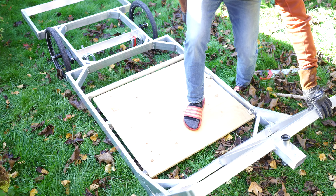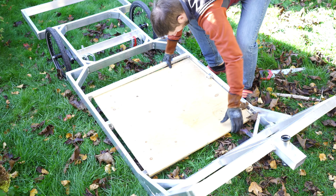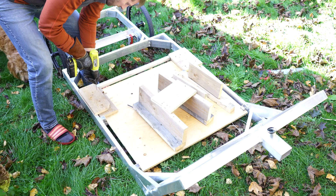This is pretty exciting. I'm using a piece of plywood here creating a makeshift platform. I'm going to do a weight test and load this up with the full max load of 430 pounds that this frame is supposed to be able to hold — we're about to find out. I'm using some deck screws to screw on supports near the end where it doesn't have a cross member to rest on underneath, and then we'll be ready to go.